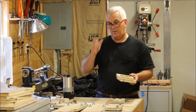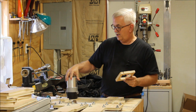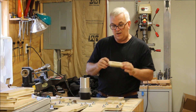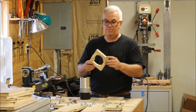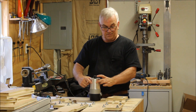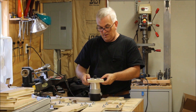Whether you got the kit from me or cut it yourself, the plans call for a three-and-a-half inch diameter router. DeWalt, Bosch, Porter Cable all make one. This is a Porter Cable 690. When you get your kit or cut these parts, make sure before you glue it together that it actually goes on your router. The Porter Cable 690 has these little tabs or bumps, and I noticed that one of the notches for them somehow got taken out of the drawing.